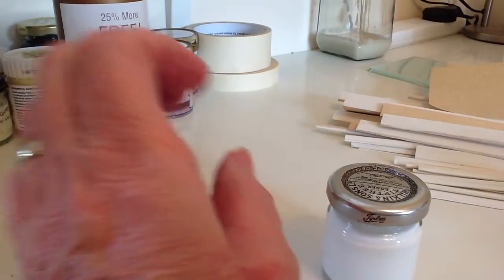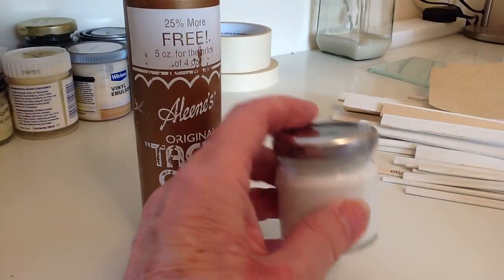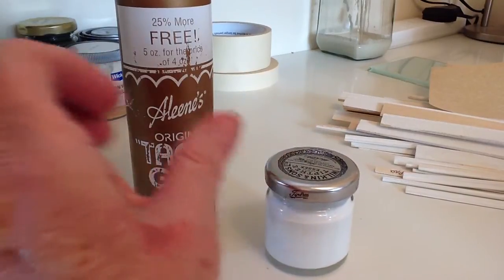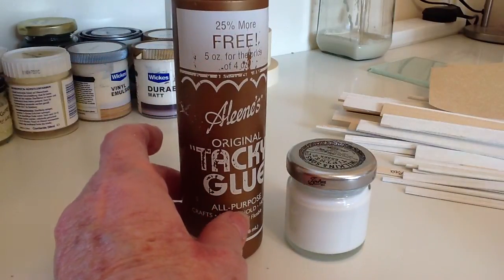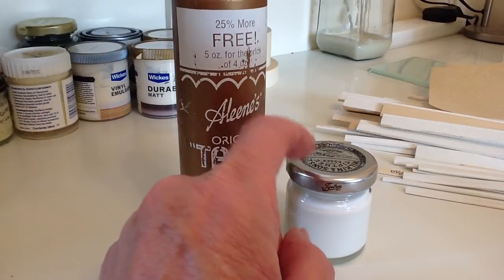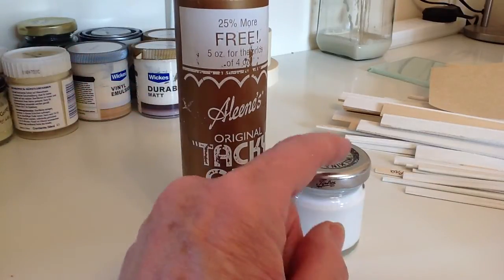This approach does a couple of things for you: one, it's frugal — it gets rid of all your leftovers. The other thing I like it for is that it's not going to make my wallpaper wringing wet when I'm trying to hang it, because that can give you all kinds of issues. Depending on the quality of your paper, it can actually tear, and more often than not the wet part of the glue comes through to the surface. When you're rubbing it down with a cloth, that can damage the surface of your wallpaper. So I like this because it stays where it's supposed to, isn't soaking your wallpaper, and you won't get bubbles, creases, and problems that come with very wet paper.